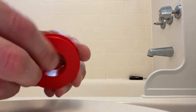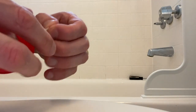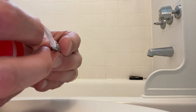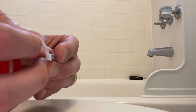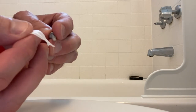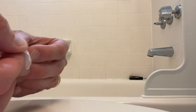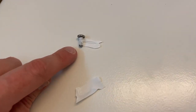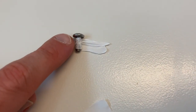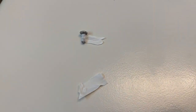There is a right way and a wrong way to do this — meaning how you apply and wrap the tape around the screw. We want to wrap the Teflon tape in the same direction as the screw will turn to be tightened, because if we did it the opposite way we'll run into the Teflon tape peeling off the thread as we tighten the screw, and that would not be good. So apply it properly. I changed camera angles to show you: head of the screw at the top, wrapping it clockwise.